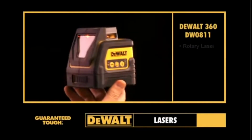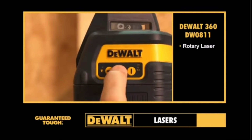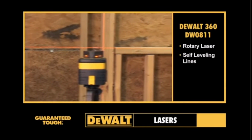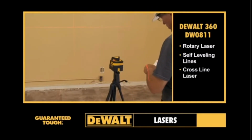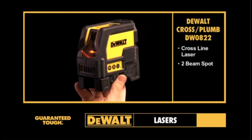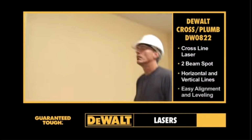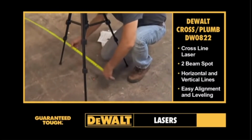The 360 delivers the functionality of a rotary laser at half the price. The 360 projects three self-leveling lines to simulate a rotary laser. A vertical line gives the 360 the additional functionality of a cross-line laser. The DeWalt Cross Plumb Laser brings together the functionality of a cross-line laser and a two-beam spot laser. Horizontal and vertical lines offer simple, easy alignment and leveling. Two self-leveling beams provide accurate plumb point transfer.